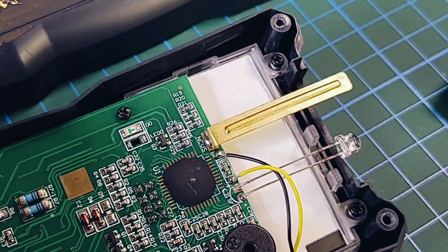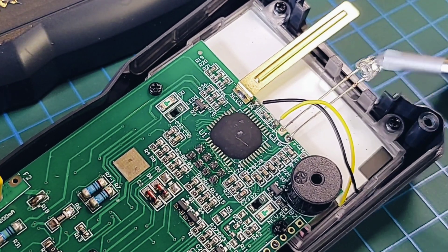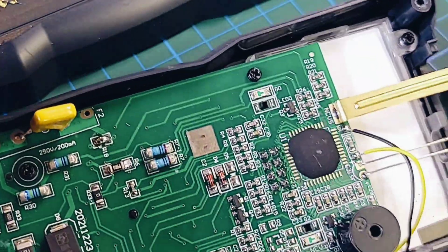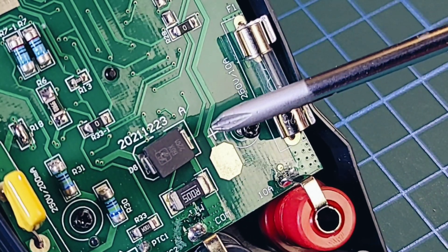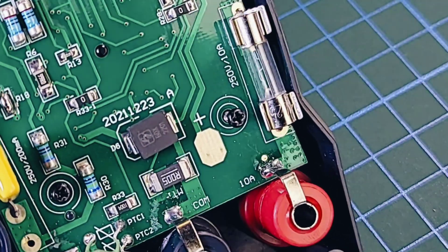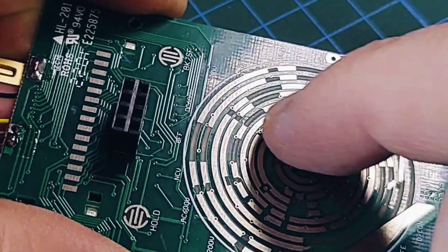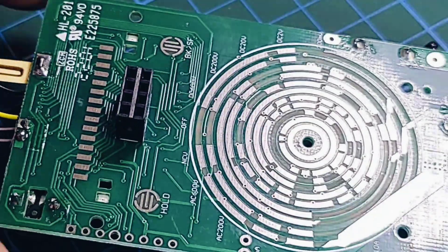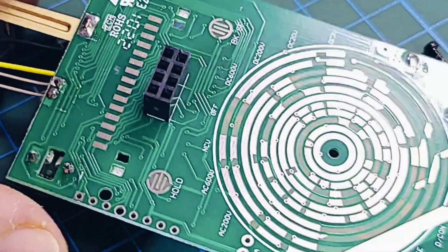I love it — that is what I call NCV. There's the LED for the flashlight as well — pretty long legs on that. Main speaker over here. Fabrication date on this meter: December 23, 2021, so that's pretty recent. Flipping the PCB around — no dielectric on those rotary tracks whatsoever, so I'll probably put a little dab there just to play it safe. There is the transistor input, but that's it, nothing else on this side.